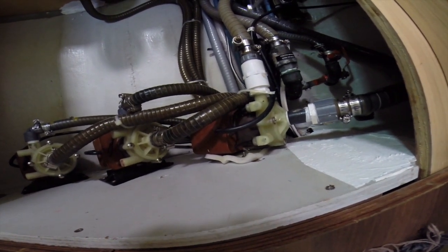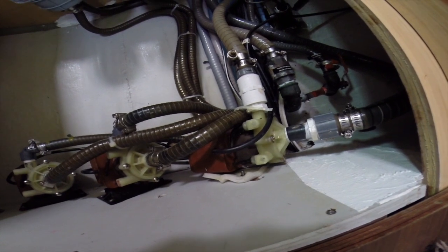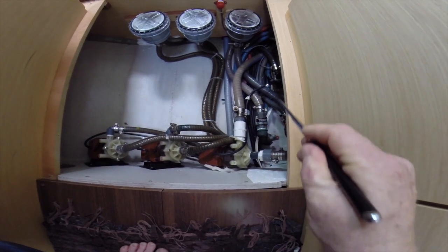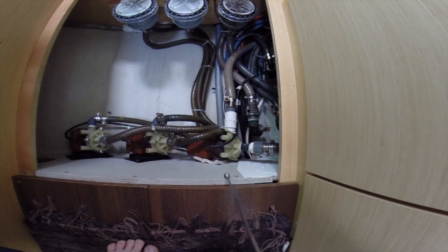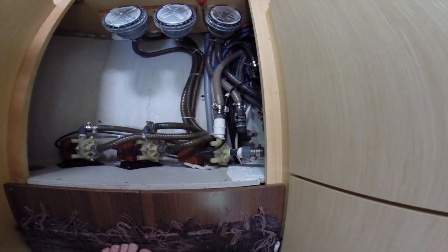This is the outlet of the pump, and basically that goes into the line that was plumbed into the boat for the raw water system on the generator. Okay, so you'll notice here is a cable. That is AC. It's 220 volts. It's not 12 volts. It's 220 volts. So that wire is wired directly to the output of the generator itself.